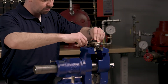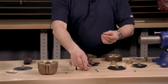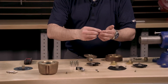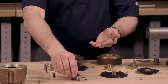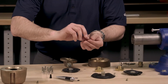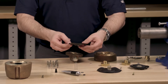Now we can start to install the new parts into the accelerator. Install the new seat into the base. Before installing the new clapper diaphragm, we will need to install the U-cup and U-cup retainer into the clapper diaphragm. Apply the lithium grease evenly around the U-cup. Install the U-cup into the clapper diaphragm, making sure that the taper side is facing down into the diaphragm. Evenly apply the lithium grease over the U-cup retainer and install it with the greased side facing towards the U-cup. The clapper diaphragm can now be installed into the base of the accelerator by lining up the holes in the clapper diaphragm with the locating pin.